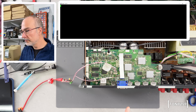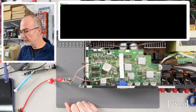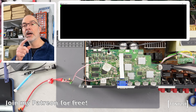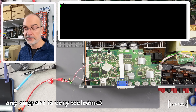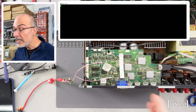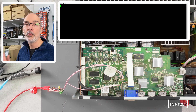Let's give mains to the 609 and turn it on. We get absolutely nothing — there is no final click, which would happen when the ARM processor is up and running and tells the main CPU: hey, I'm up and running, you can open the outputs. Unless I'm doing something wrong with the serial here, this is telling me that maybe the CPU was fake or maybe I made a mistake when I soldered it. As it stands right now, this is completely dead — there's no activity whatsoever. The next step is to swap the board and see what happens with the other board.